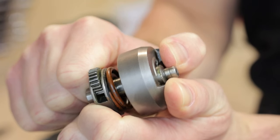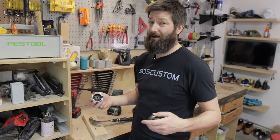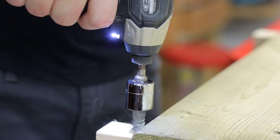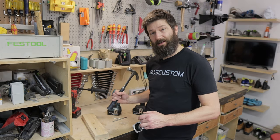Then this thing has a spring on here — it cocks back, goes up, and this little flat spot slides along the flat spot on here. So there's a momentary release of the torque that you would feel in your hand. Like when you're hammering a nail, it supplies the force and then the hammer recoils slightly, so you're not feeling all that force in your hand.